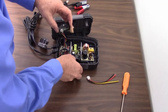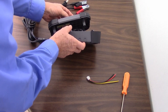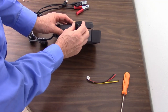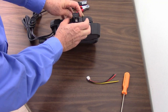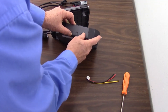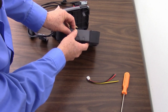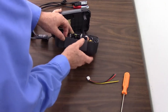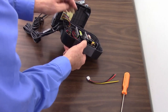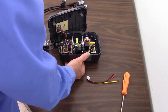Let me put these wires off so I can see how it's going to fit a little better. I'd rather have it flush if I can. So there's how much room I've got — it's going to sit right about like that. I have to lose about an eighth of an inch off the capacitor. But looking at it, I think that's not going to be in the way. So I can grind down that heat sink. I'm a little concerned about that because, of course, if I grind down the heat sink, it's going to lose some effectiveness. Maybe I can do something about that.